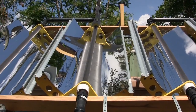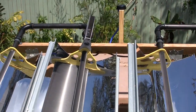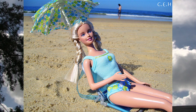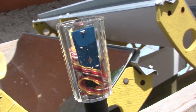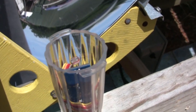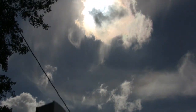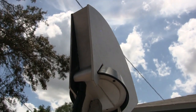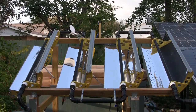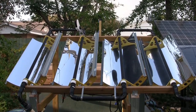If it is sunny when it starts moving, the Arduino moves until it sees a shadow. The tricky part is dealing with clouds. There are actually very few days when it's sunny continuously all day. There is another sensor which checks if it's sunny, cloudy, or rainy. It is a light-dependent resistor housed in the lower half of a solar garden light. A spice bottle is used for a rain shield. So if the sun darts behind a cloud, the Arduino moves for a predetermined time. I programmed the control system to track the sun all day and then return to the east-facing position awaiting the next day.